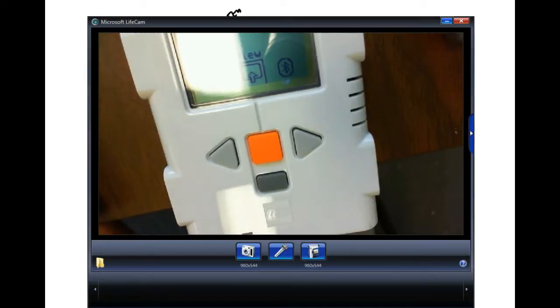So if I wanted my robot to go up 6 inches, I want to know what this ultrasonic puts out when it sees 6 inches. What we have the ability to do is look at the signal before it goes to the A to D converter. So let me find one of my cables. Oh, there's my sound sensor. And I'm going to hook up my ultrasonic sensor.